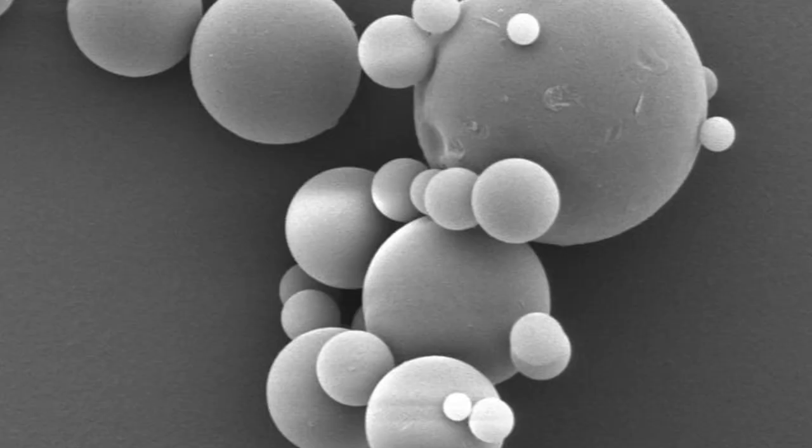The image on the screen, taken with a scanning electron microscope, shows some typical particles that were made by spray drying. You can see that they are very smooth and spherical. The shape comes from the drying process — the droplets are spherical, so as they dry, the precipitate is also spherical. They are smooth because, as drying is so rapid, the molecules don't have time to crystallise and so become amorphous, and we end up with smooth, free-flowing powders. Not all compounds can be made amorphous by spray drying — if a compound can crystallise in less than one or two seconds, we will get crystalline particles.